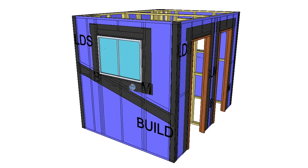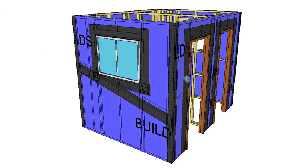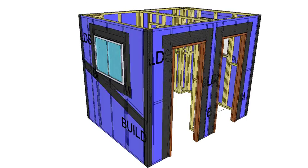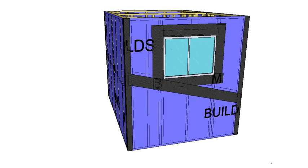I've also flashed down this corner, and you can see I've got the same setup on my doors. So because I'm going to cut my weatherboards down the side of the doors, I've got flashing down there, so just in case water gets in behind that join, then it's not going to affect my frame. So you need to flash everything as well.